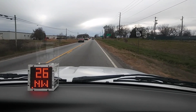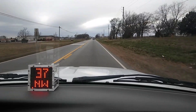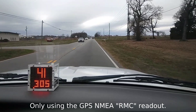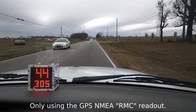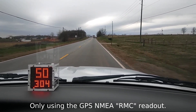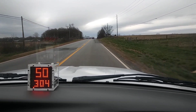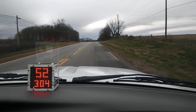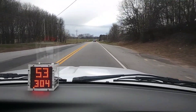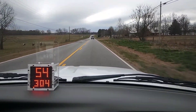This is based on the GPS — it takes two points to get a speed and also to get your course over ground. The actual course over ground right now is 305, measured from true north. The GPS module supplies this; speed comes out in knots so you have to convert it to miles per hour, and the course over ground comes out as true north, which you can convert to an azimuth or whatever you want.